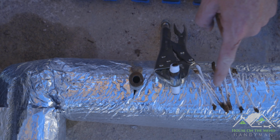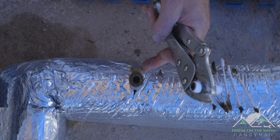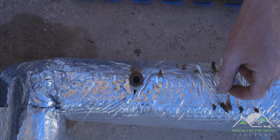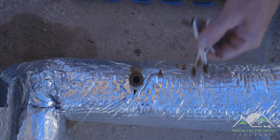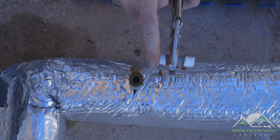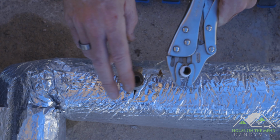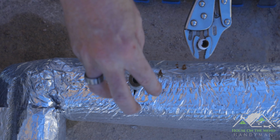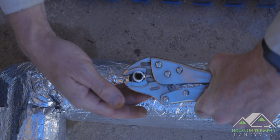All right, so I went through a whole bunch of Q-tips cleaning out this pipe as well as this fitting here and both sides, and got down to the point where it was really just some kind of slightly muddy water, so I think we're doing better there. Now I've applied thread tape to both sides of this stem, and we're going to put that back in here, and then we'll put in our pressure gauge, and then finally we'll mount the new pressure switch. So let's get this guy started.